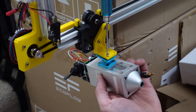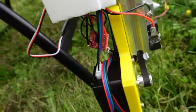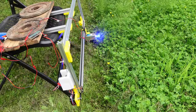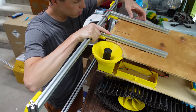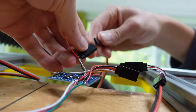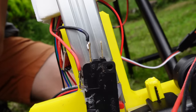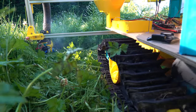The laser was mounted on the slider and I set it up in the yard for a static test. It doesn't seem like it's really doing all that much, but hopefully it works better on the rover. So then I mounted the slider on the rover and installed another Arduino that plugged directly into the Vesk motor drives. This Arduino would tell the rover to drive forward a certain amount every time the limit switch on the laser slider was triggered.